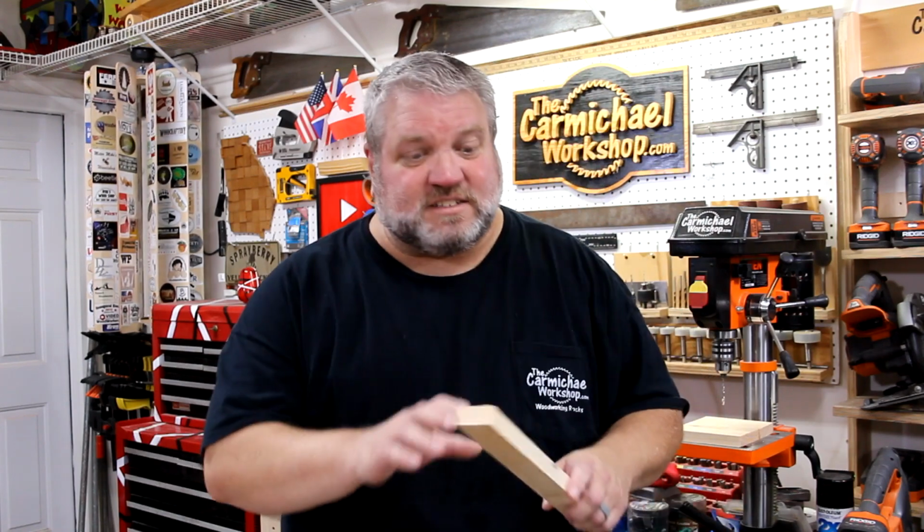I'm going to cut a short piece of this 1x2 to glue across the bottom opening, and that'll give me something to screw the bottom onto. I don't think the birds will mind if this is underneath them, they'll just build the nest on top of it.